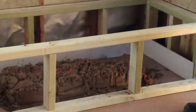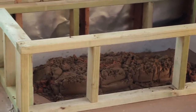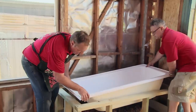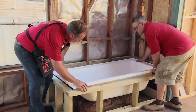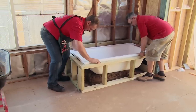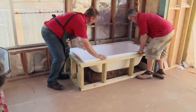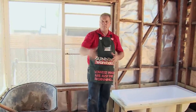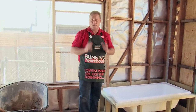The reason we've only filled three quarters is that we need to save some space to allow the plumber to put his piping in. Now I'm going to grab the bath and place it in the cradle — I'm going to need some help for this, so I'm calling my mate John in. We're now putting the bath in the rough position and going to wriggle it around a little bit so that it moulds inside our cement. We've now completed putting the bath in. We just need to make sure it's in the right position and move the mortar around the base of the bath so that it's fixed in position.